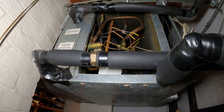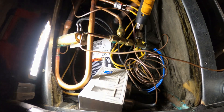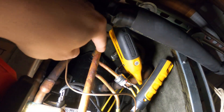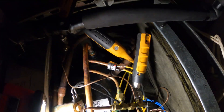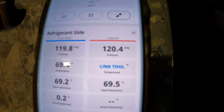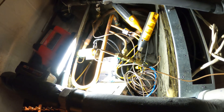It's definitely not cooling in here and I can see right away that we have a pressure control that is bypassed. Off the bat this pressure control is gone, and there's another one right there that's also gone — looks like they put in a dual and just literally have it laying in. I got my digital gauges on there right now and we have basically 120 pounds standing pressure. Our suction line is room temperature, about 69 degrees. Let's see what's going on.